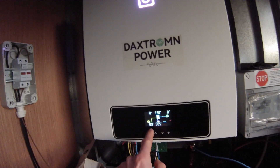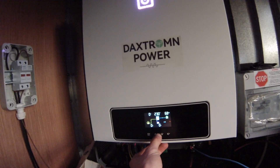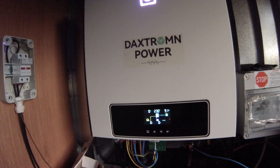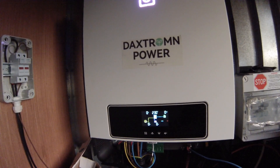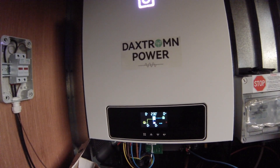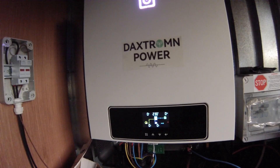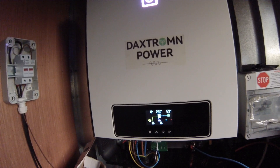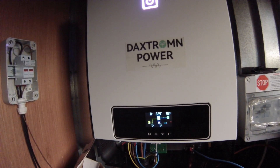The MPPT has pulled the voltage down to 90 volts but it's not sufficient to charge — that's basically just the drain of the battery. So if you have the inverter off and the sun is rising, weird stuff happens. If you leave the inverter on you drain the battery. That's why I have a 3-minute auto-off timer when there's no power consumption, but that causes trouble when the sun is rising.